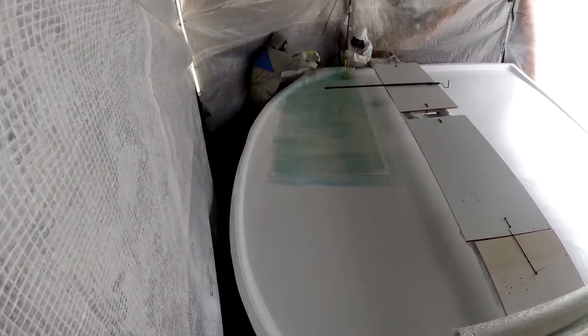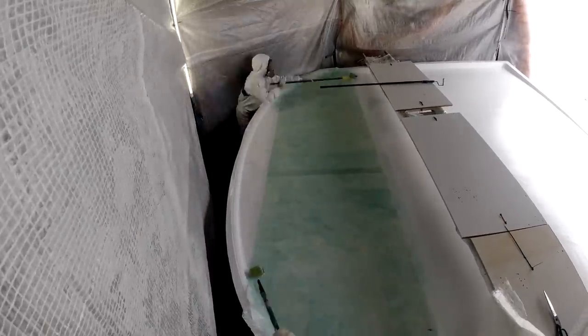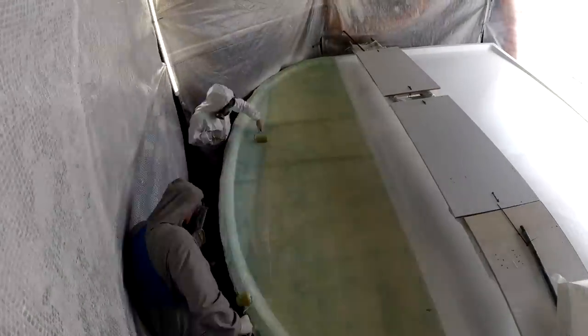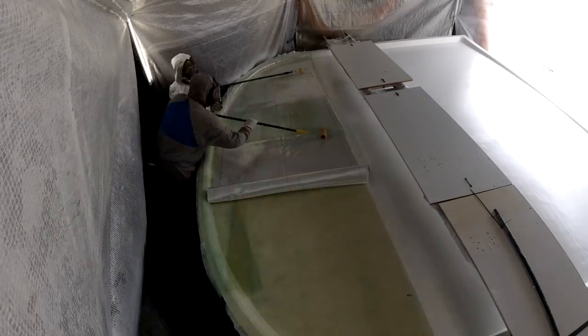As Janet and I apply the first couple of layers here on our hardtop, I just want to answer a question about gel coat, whether or not it's a self-leveling medium. Gel coat and flow coat are not self-leveling, and that means that really the important part of this is actually the mold surface. The gel coat will reflect exactly the mold surface, and it's vital to get that gel coat not too thick either. It's generally around 0.5 to 1 millimeter or 18 to 20 mils in thickness,